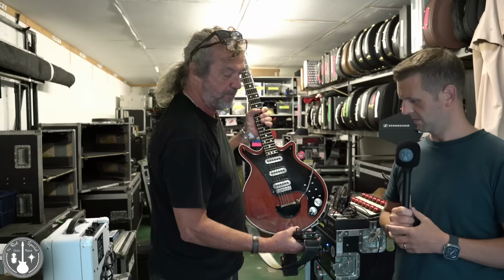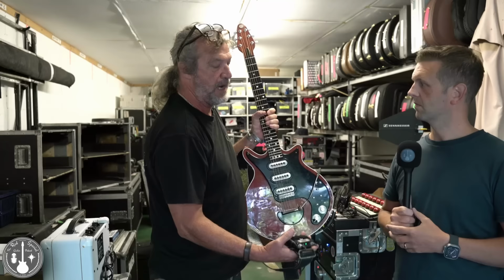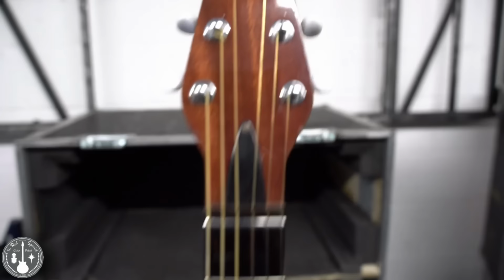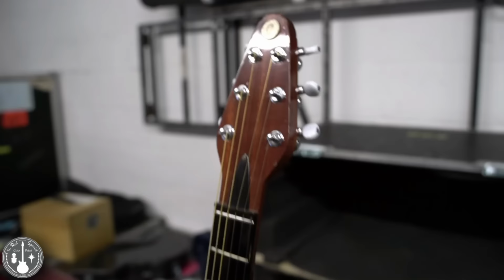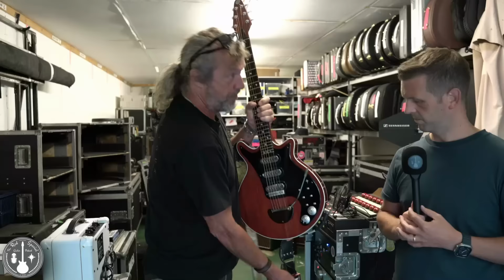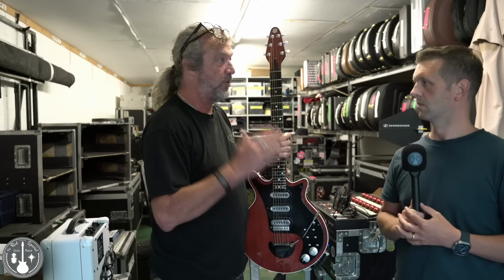New radio system from, we've talked about having a digital system for a few years. It gives you so much more scope to use different frequencies. Right. On the analog system, if you were locked onto a particular frequency, you would get spill on either side. So if you were close to something, it would pick that up. Yeah. With digital, because it's either there or it's not, it's like your digital radio in your car. It doesn't fade out anymore. If you go out of signal, it drops, that's it, it's gone. Yeah. Because it's locked into that one particular signal.